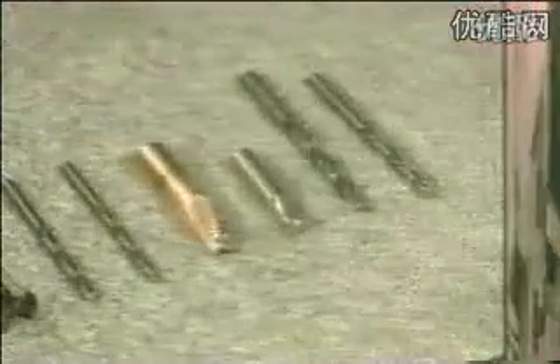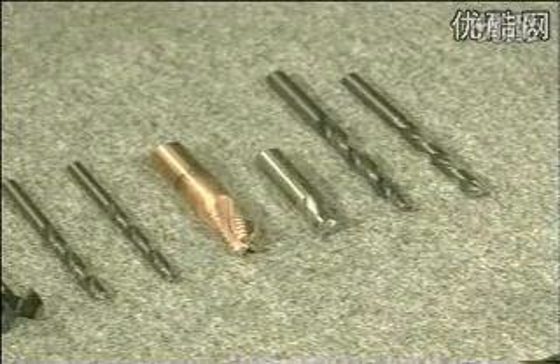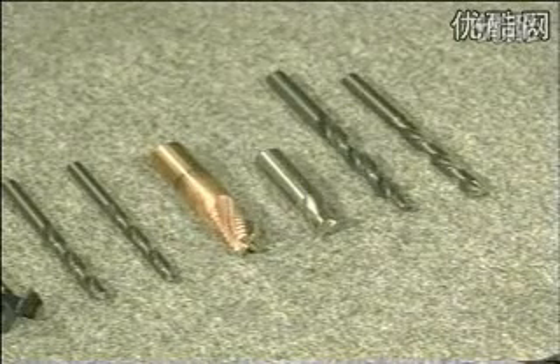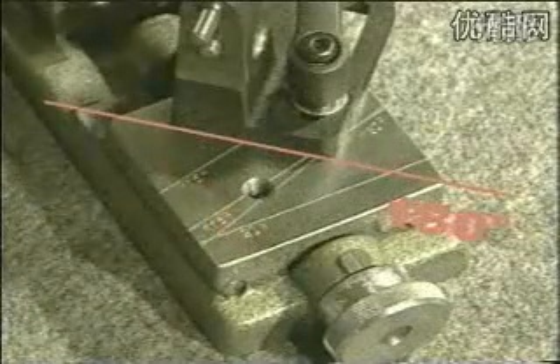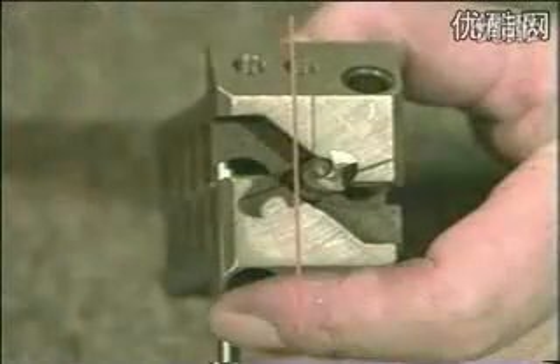To sharpen drill bits with a 180 degree angle like wood bits or sheet metal bits, set the prism support to the 180 degrees line on the base plate. Brad point bits are set in the same way, cutting edge to the double lines.